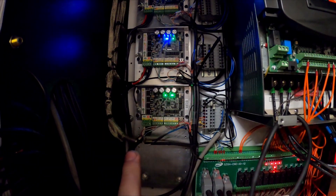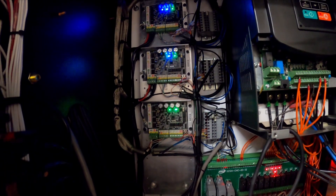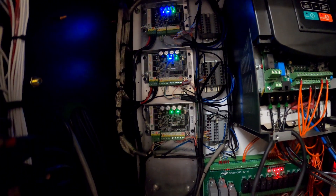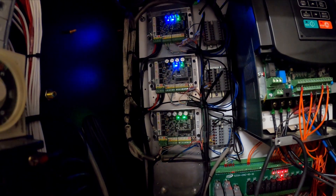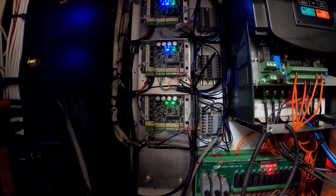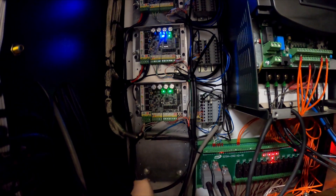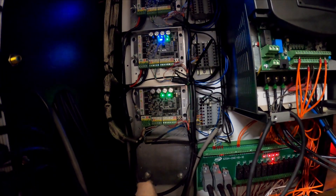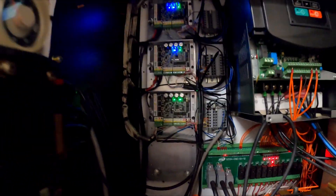Now these are Back drives — they're probably the easiest drives I've ever tuned. Literally from wiring them up, downloading the software, programming them, and getting them running took 30 minutes. It was really easy, they run great. The only issue is they're only 20 amps and they're at 160 volt. So I get the speed, I just don't get enough torque.